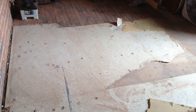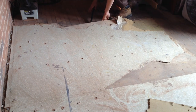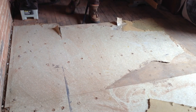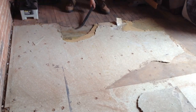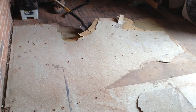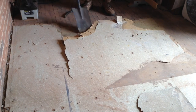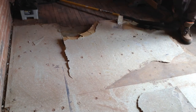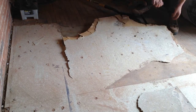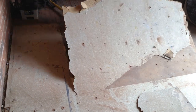You can see I'm taking up the original linoleum. This was the floor that was there when we moved in, and there was a washer and dryer right behind me, so I knew there was going to be some watermarks on the floor — and there were. But the part where the watermarks are is covered by a carpet at this point, so that wasn't really a huge issue. It was easier to take this off in two layers. I had one of these big shingle wrecking bars — if you don't have one, you don't need it, a crowbar works just as well.